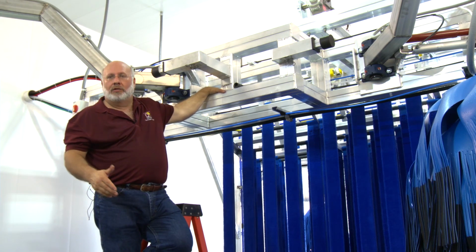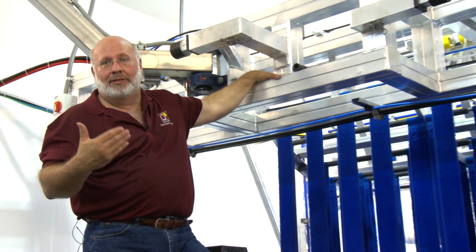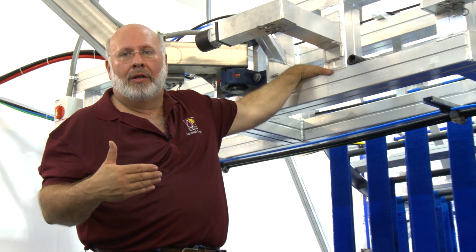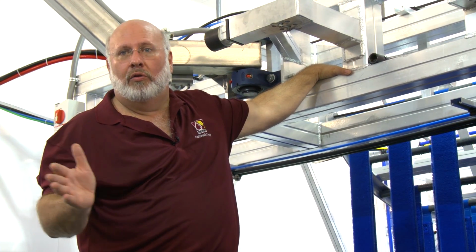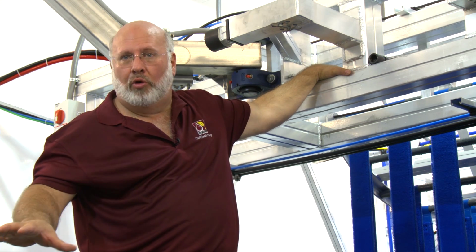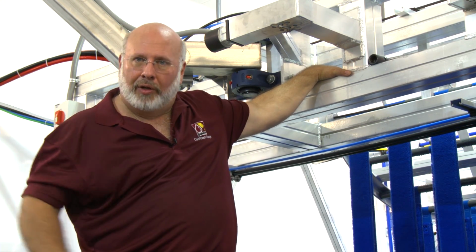In some extreme cases, if you've got a great site that's washing in excess of 150, 160, 180 cars an hour, some guys would like to get this brush a little bit more aggressive. And air pressure alone is not going to do it because the RPMs are so great that it's staying off the car, washing the side real nice, but doesn't load up on the back.